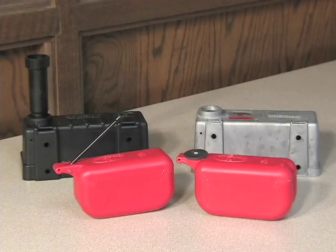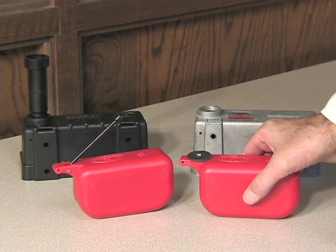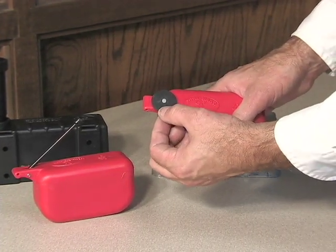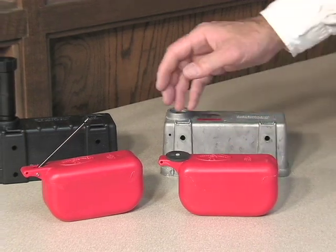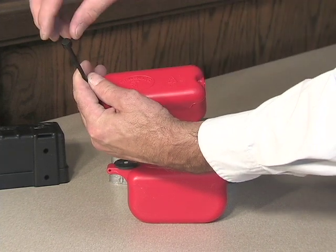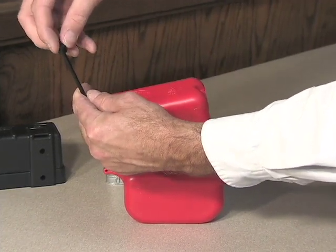To prolong the life of this product, it is recommended that you rotate the valve seat as needed. For the non-anti-siphon models, simply rotate the valve seat on the float assembly. For the TM825AS and the TM830AS, pull the valve seat out of the valve stem and flip over.